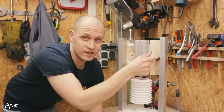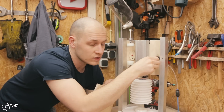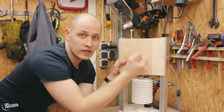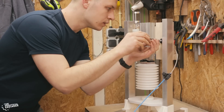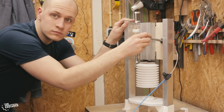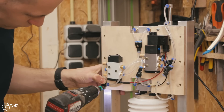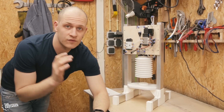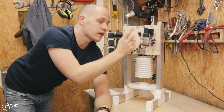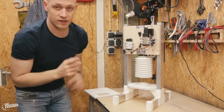Now I have the push button here and I brought this lever to the front. I'm going to put a cover here — this lever is a bit too short, so I need to extend it so I can make a hole in here and the lever comes through. I have all the electronics and pneumatics wired: the tubes to the cylinders, the electronics to the electronic cylinder, and this one is just manual. Let's turn it around and install the front panel.